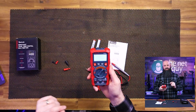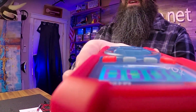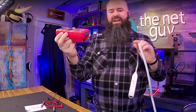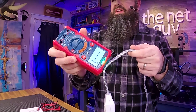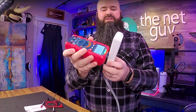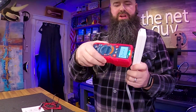Another thing which I never see at this price range is a non-contact voltmeter. Right here on the top it has this little tiny hexagon sensor. I'm going to switch this all the way to the right — that's live NCV mode. What this can do is find live line voltage. Now you can see what it's doing — see that green light? It's so sensitive it would literally detect current on that line. See how it says H for high and shows a red light, now green for low. So it can detect stray current on a line. This is plugged in, which means it's live. I can do the same thing by just pointing it at any outlet to know that circuit is still on. Maybe you're doing work on an overhead lamp or installing a new lamp — these are amazing because you can put it up there and know if you have current available and avoid electrocuting yourself.